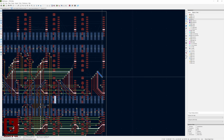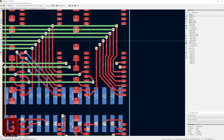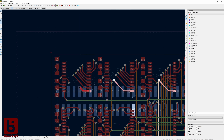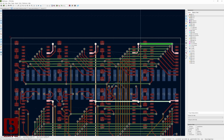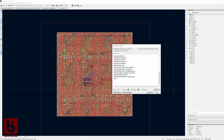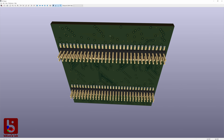I used KiCad to design the board and it was actually the first time I did a four-layer design. I put them in a matrix arrangement so each MCU has an individual LED, and they are pink. To communicate between the MCUs I decided to put on an 8-bit bus. The remaining IOs are used for a debugging pin, the reset, and some GPIOs that can be routed to an edge connector. This way we end up with plenty of IOs and an ADC per MCU.